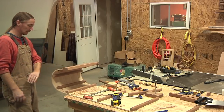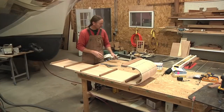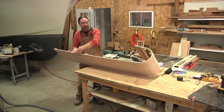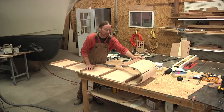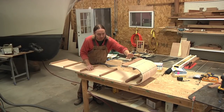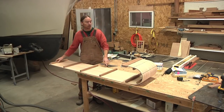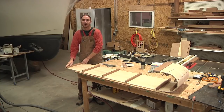I'm going home — I got a lot done today. I'm gonna take some pictures first, but yeah, calling it a day. I decided to spare you the monotony of a bunch of sanding, so I didn't show any of that, but what I've done is come through and sanded and flattened down the bottom as well as the tops. I started rounding over some of the mahogany slat highlight areas, and I've gotten this breadboard cap finished. It looks really sharp — I'm really happy with this. Now I need to come through and remove each of these cross slats and round those over so they're a little easier on the eyes and a little easier on your butt too.